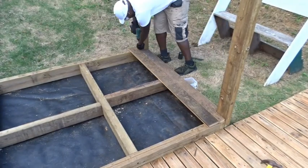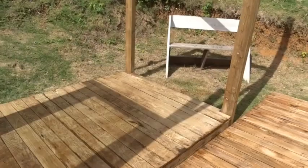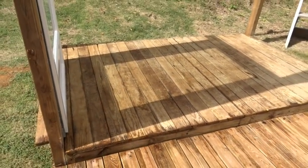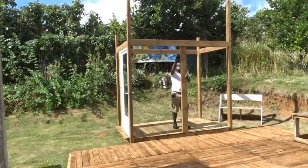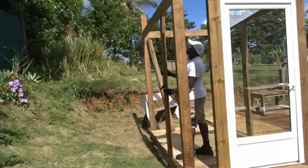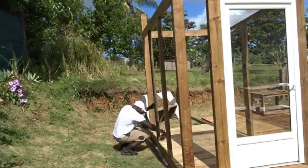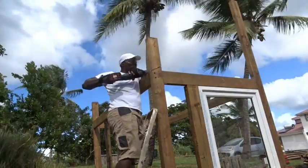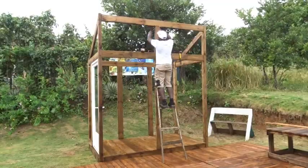Now I'm showing you how I'm doing the floor. But keep in mind that the floor needs to be done before adding the door, because the dimensions going underneath the door are very important for the rest of the design. And I'm adding some other big pieces of wood all around the design in order to complete the frame and make sure that it's stable enough.